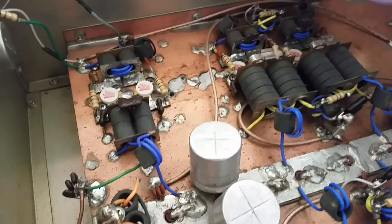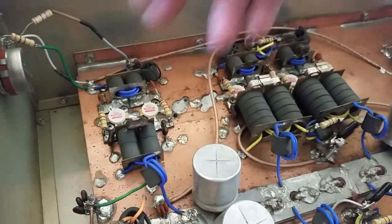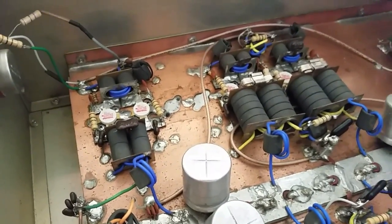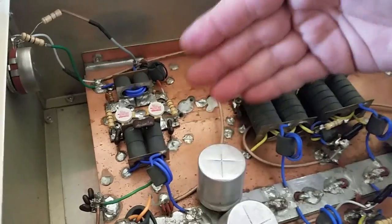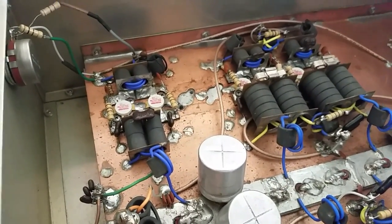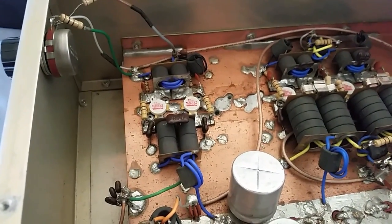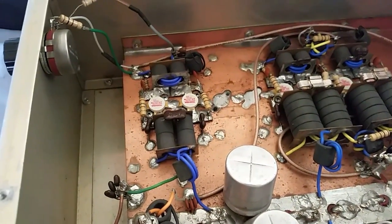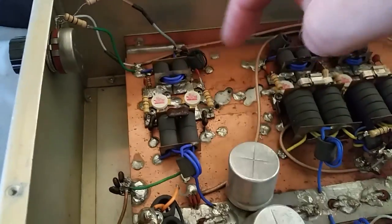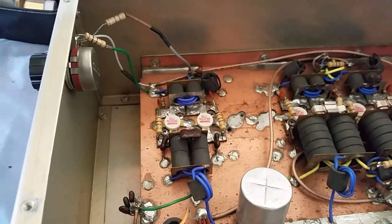So it just allows you to use a little bit bigger of a radio with a box. You're going to have to put a little bit more into the box to get the full output out with two 2879s, which a lot of that has to do with preference, with what kind of radio you're running. If you're running a small radio, you're going to want two 2290s. They're going to get up and go with a little bit lesser drive because they're not as powerful as 2879s. But anyway, me personally, you don't need this no more. I may call and talk to you about that, but you really don't need this no more since it's going to be two 2879s, but it ain't going to hurt leaving it in. It ain't going to hurt at all. But I'll talk to you about it, see what you want to do.